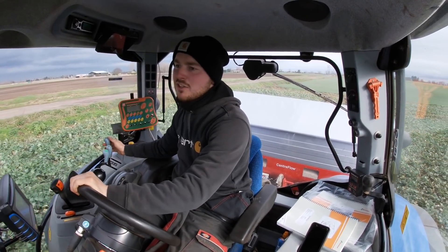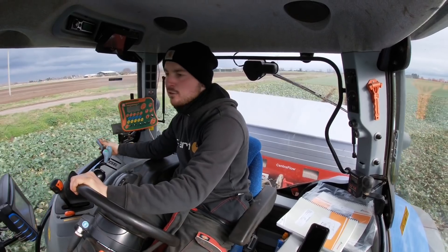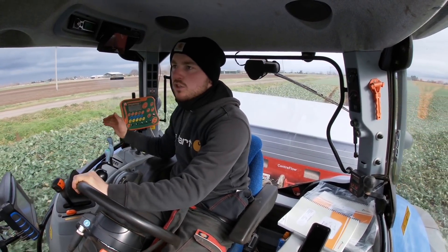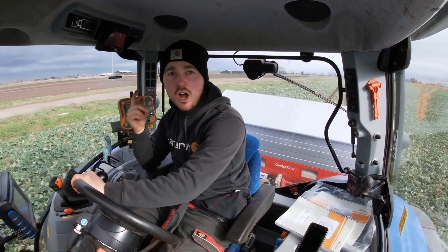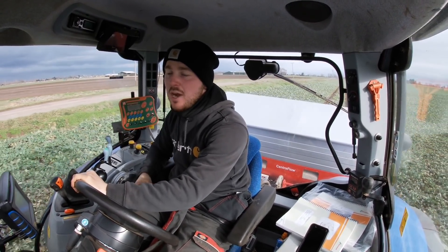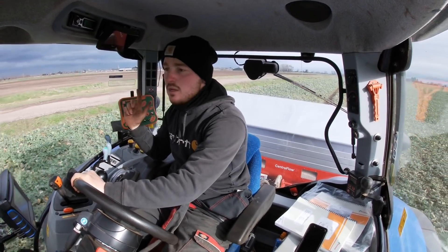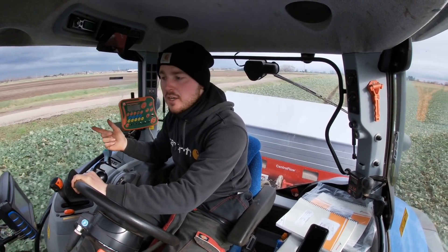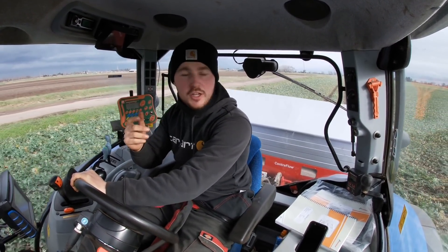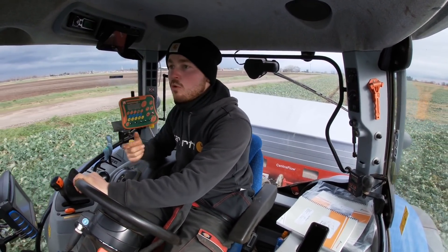I do like this headland limiter. You just hold the brown spool and once I've gone around the headland, the limiter lifts up and then I can start going up and down my tram lines at 18 meters. With this spreader, if we get a bigger sprayer or anything like that, we don't need to alter the vanes — you alter the back lever. I'll show you when we get out and have a little walk around.